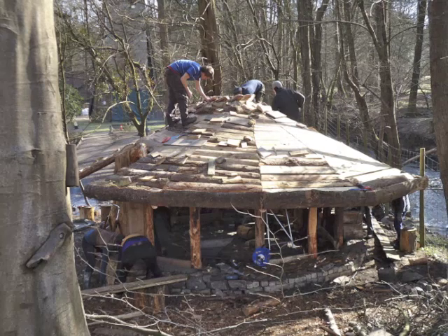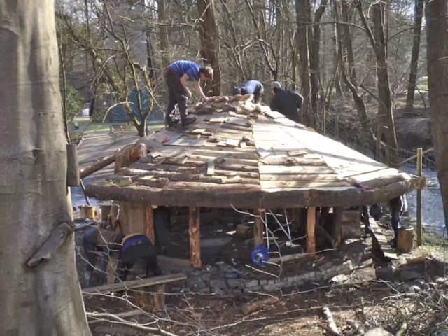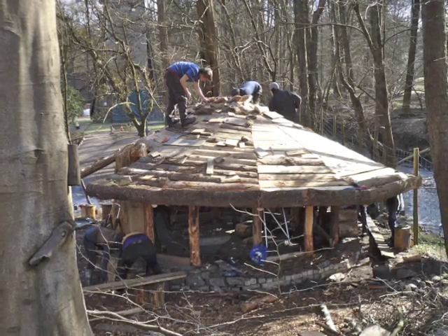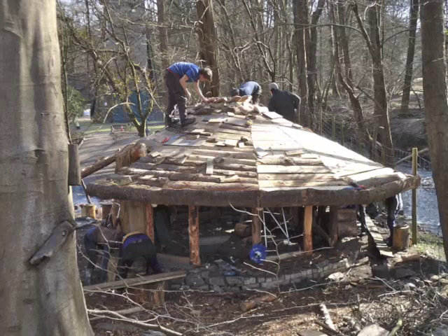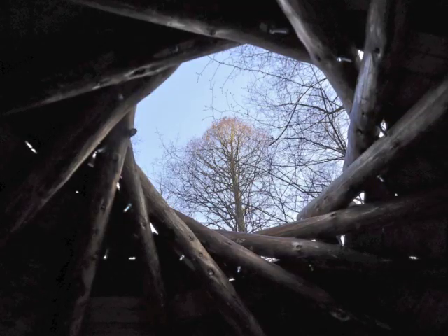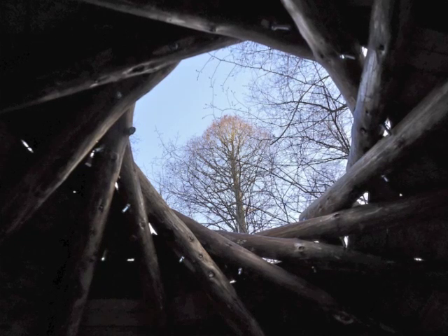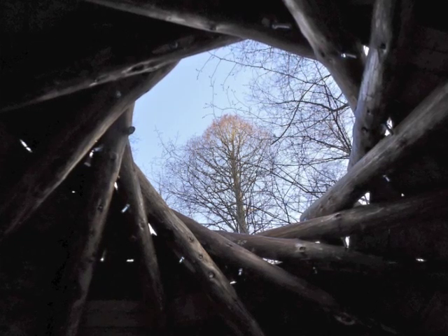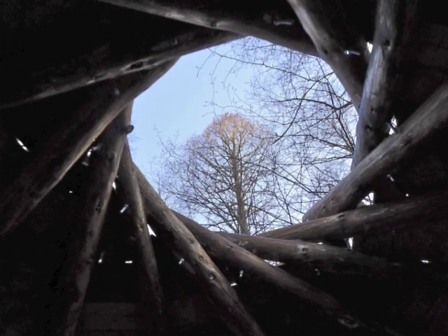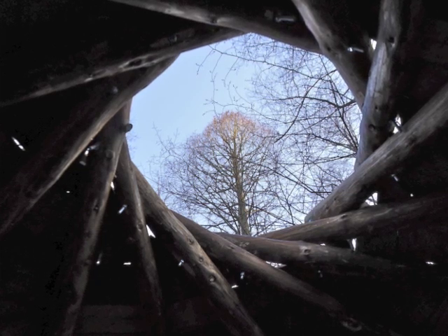Here you see the roof being completed. The tops of the rafters have been trimmed. The roof is being built up to the tops of the rafters to allow for the windscreen to sit cleanly on them. The eaves have been fitted round the bottom. There's a view from the inside of the roundhouse now — it's starting to feel like an enclosed space with an acoustic, a bit of rainproofness. We'll retain this nice view with a windscreen on top.